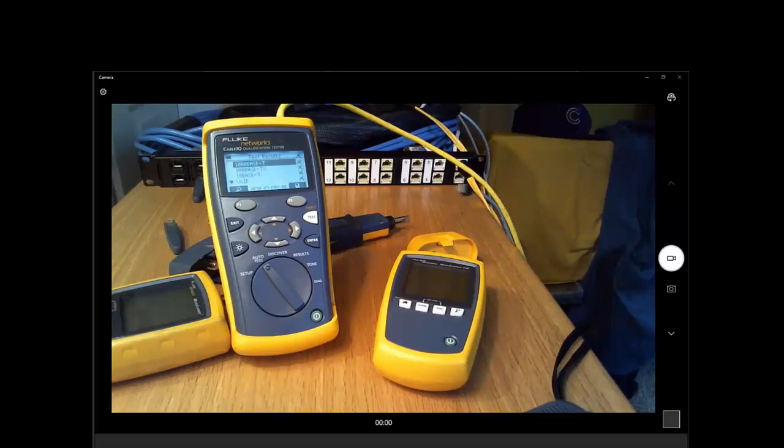Adrian, one thing they also asked about was PoE. If it's an IEEE standard PoE switch implementation, the instant that you disconnect it from the powered device at the far end, say the camera or the access point, the switch will stop putting out power. So you're safe there too. You don't have to worry about PoE.